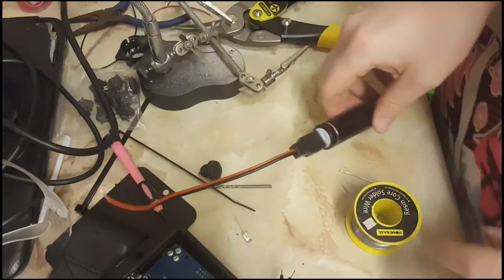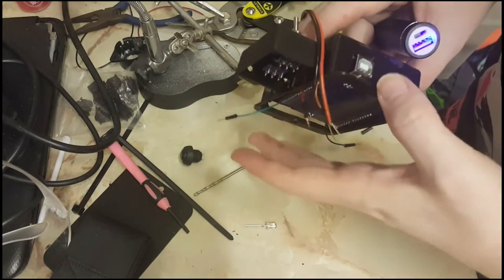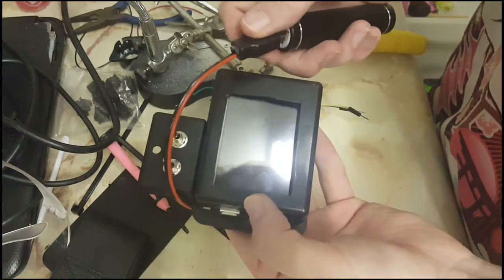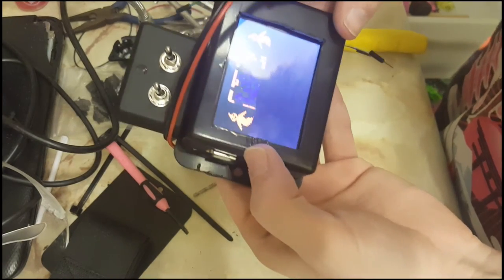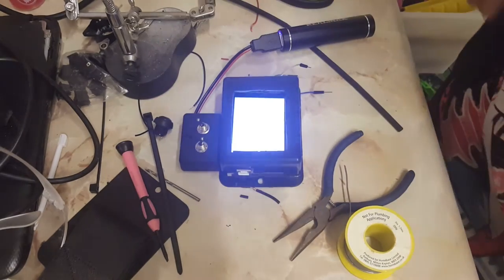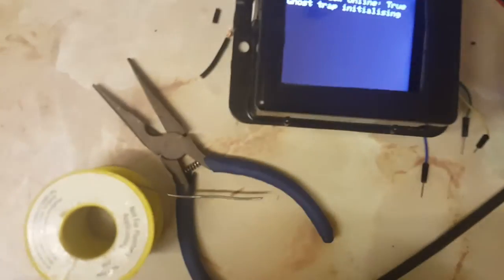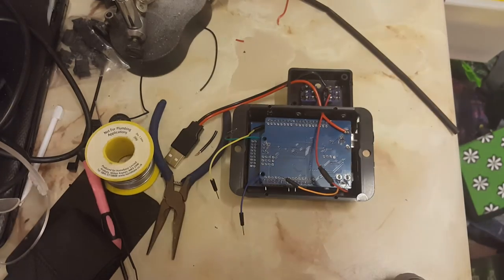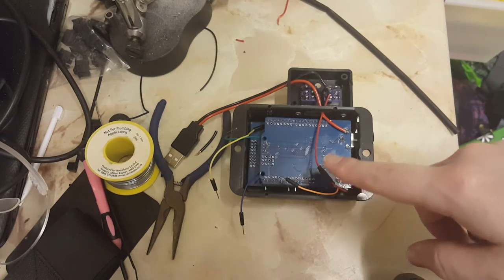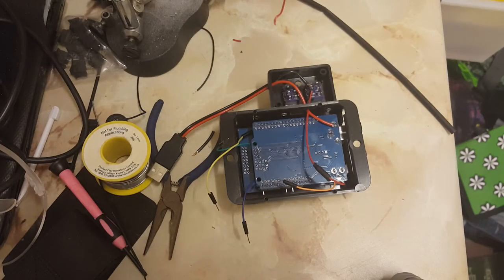Safe to handle. First power test — budging some wires together because it's the first test. Please don't short circuit. This is the first test to see if the armband unit works — and I'm gonna say that's a yes! The first set of wires are connected up so we now have power to the unit. You can see the Kenner logo comes up. The ground cable, which is on the wrong wire — it's on the red wire — has gone into the ground. The power cable, the plus five volt, comes up to the switch and then heads off to the battery. All that without blowing up the flat — well done Danny.